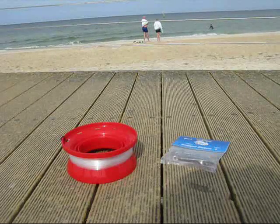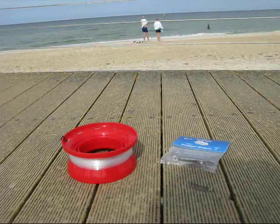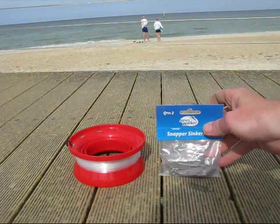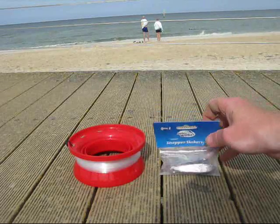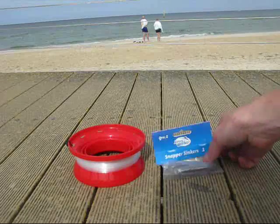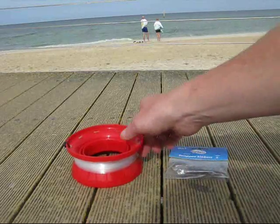You saw the squid pole before, and that's great for beach operating when there's no trees. But if there are trees and you can't afford the space of a squid pole, well, you can take some fishing line and some sinkers. You throw the line over a tree and then pull the antenna over. And these only cost a couple of dollars from Kmart.